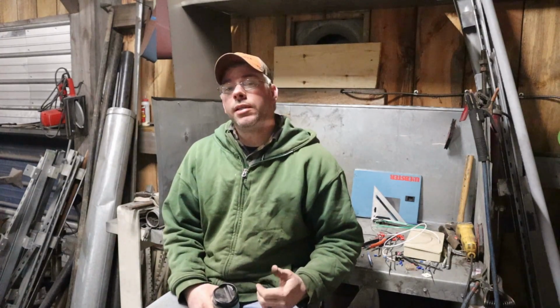I had mentioned that when you run the load on it, the voltage actually cleans up some. I think I showed you guys that on camera. What happens is you have another induction motor tied into that circuit. I don't have time to explain it all, but it actually cleans up your power a little bit. So they say if you're running more than one piece of equipment on a rotary phase converter and your voltage isn't as clean as you want it to be, turn another tool on, let it idle, and a lot of times that will clean the voltage up really well. Now I'm real happy with that. You guys saw the voltage readings under load were really close. The amp draws were really close. It's within that 10% safety range that you have to operate in without hurting the equipment. That's what we're looking for.